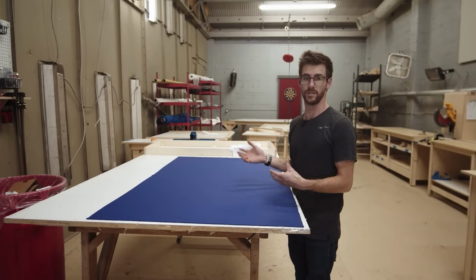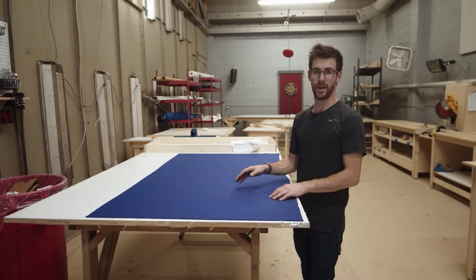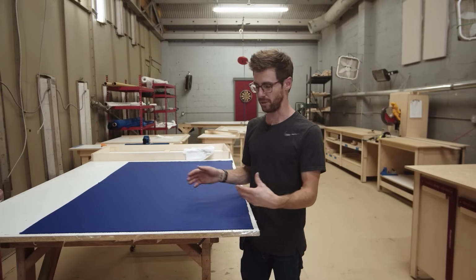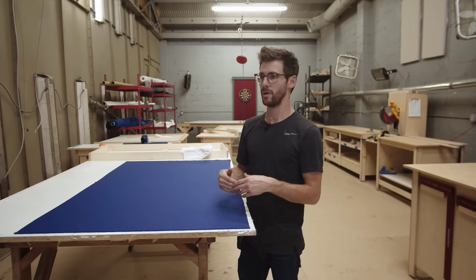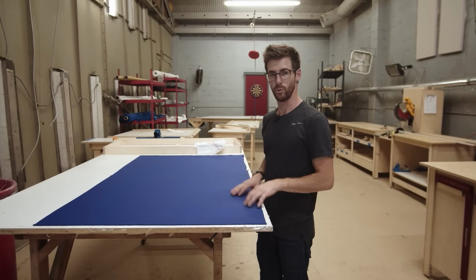The biggest thing is you want to make sure that it's acoustically transparent so that it's not going to be reflecting any of that energy that you're trying to absorb back into your room. Typically the thing people say is as long as you can breathe through it or blow air through it and it'll get through, so will the sound and the acoustic energy in your room. And that is a pretty good rule of thumb to follow.